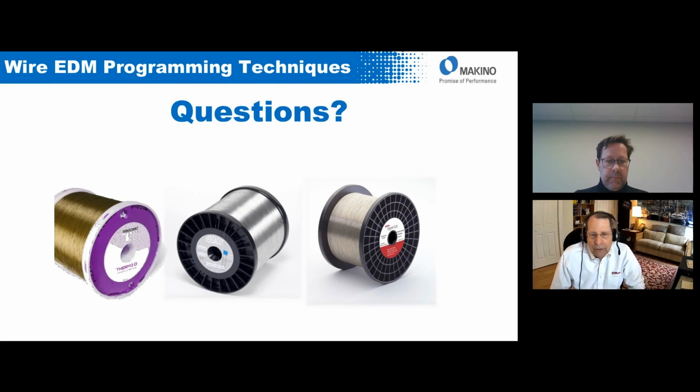I've done quite a few studies. I work with the University of Connecticut. We do electron microscope chemical analysis called EDX, and we have analyzed many specimens. By the way, this contamination occurs in sinkers too. In sinkers, you also get carbon contamination. So you get a portion of the electrode, a portion of the dielectric that bonds into the surface, alloys into the surface.